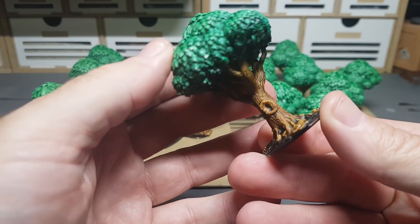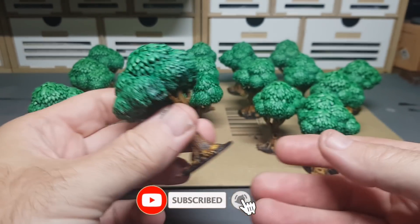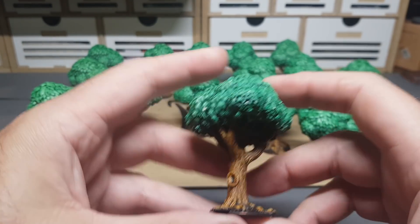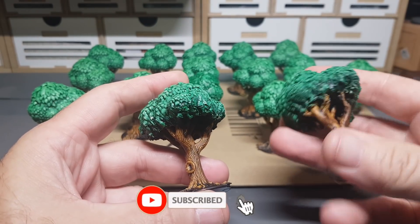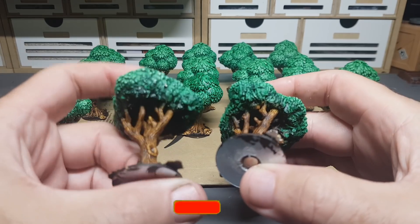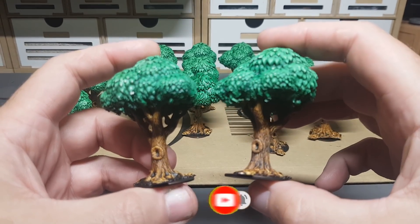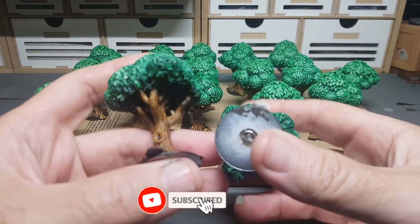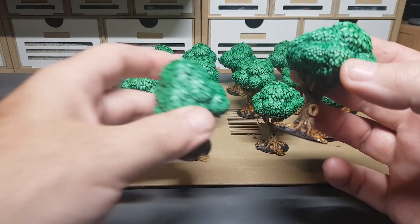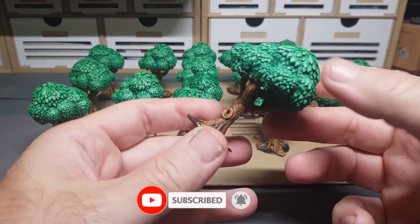I've glued them down onto a little metal washer to add weight to the bottom, and I've also put magnets in all of them. In terms of costs: 3D printing is approximately 60p each, while resin casting is 30p each. You do need to factor in the mold cost at roughly another pound. So if you're going to make lots of a certain thing, it's best to 3D print it, make a mold, and cast lots of copies. Hope you enjoyed the video — leave a comment, hit thumbs up, subscribe and turn on the bell.